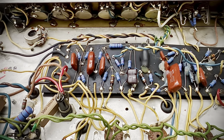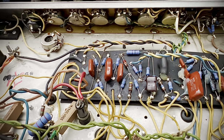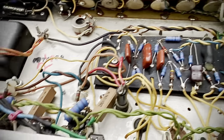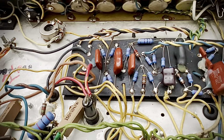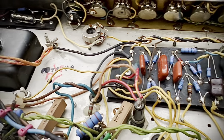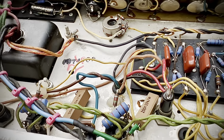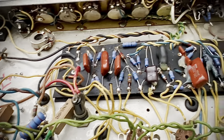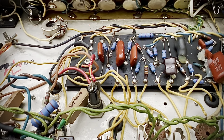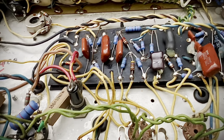Your reverb tank is meant to be vertically mounted. It looks like the dude just left the bag at the bottom of the head shell cab. But I'm going to go ahead and mount it as intended. If you notice the different part numbers, I went over this in a previous video, the alphanumeric designators on your reverb pans, and you can see what it shakes out to be. Some of them are meant to be mounted horizontally, face down, others face up, others vertically, and yada yada, the whole thing. So, there you go.